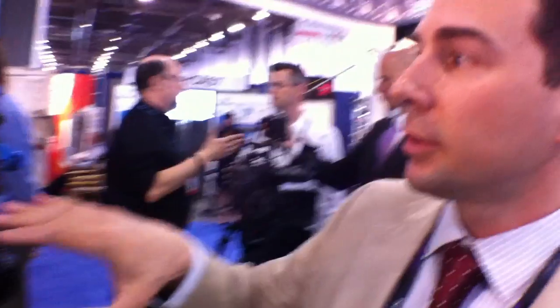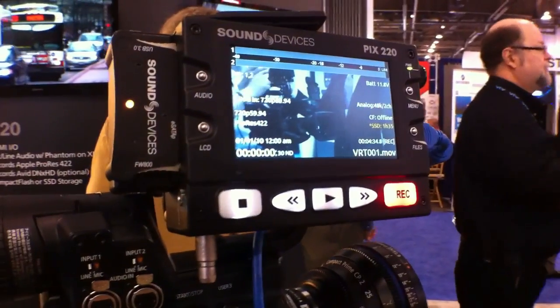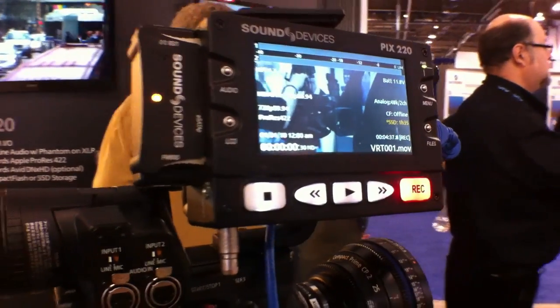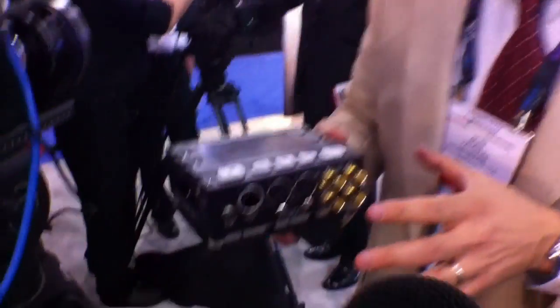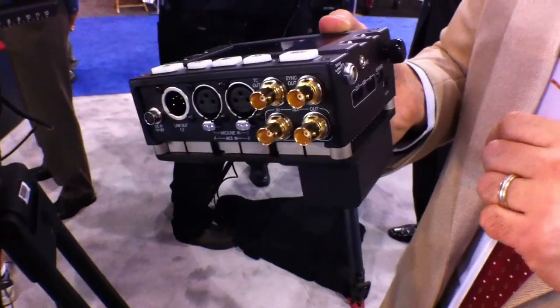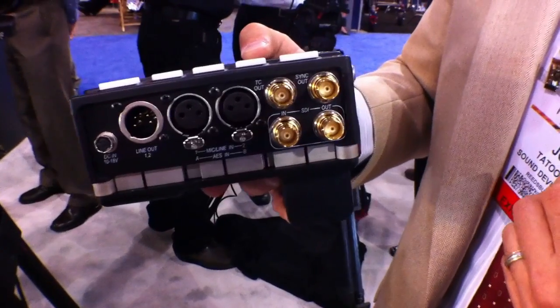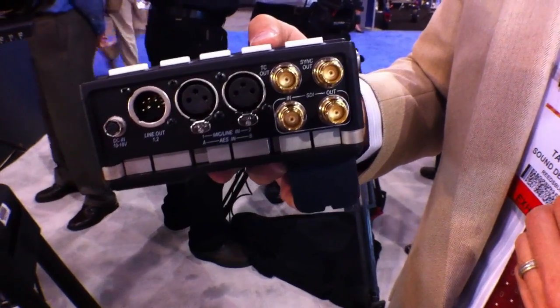What's the price point? There are two models — the PIX220 and the PIX240. The PIX240 has everything the PIX220 has. The PIX220, which is the HDMI-only unit, is $1,700. The PIX240, which includes full timecode circuitry — a 5-pin LEMO for timecode input and output, LTC output on the LEMO, full Genlock output on a BNC, and word clock selectable instead of Genlock — is $2,800. So for multi-camera or double-system sound applications, the PIX240 is going to be the most flexible piece for you.